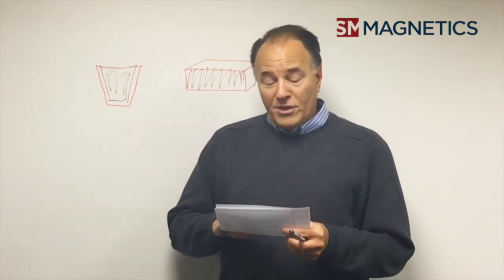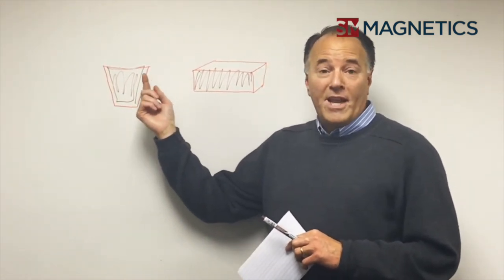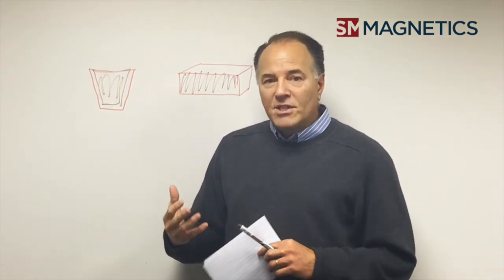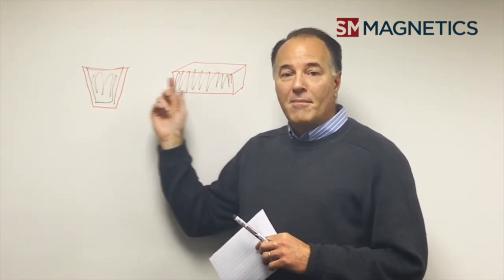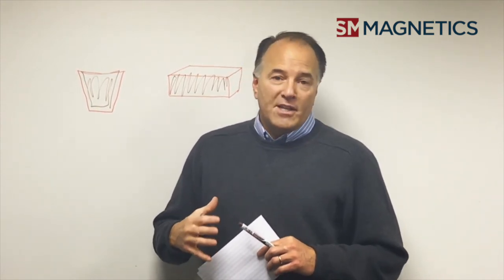For this illustration, I'm going to take it one step further and go the reverse. Sometimes we get questions: can I take a magnet and go from an N45 down to an N42 — actually reduce the magnetic field? The answer is yes, but it is not something that we recommend. The minute you start to take that magnet away from being saturated, you can actually make the magnet less stable.